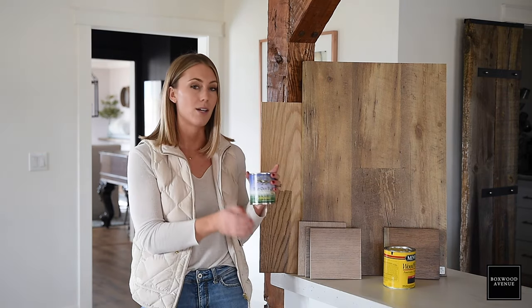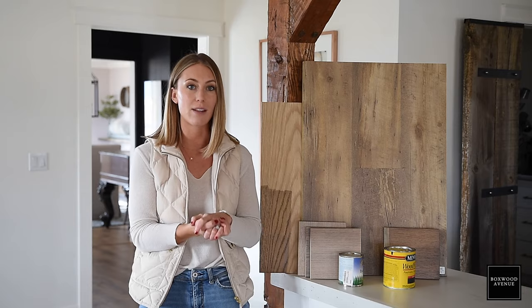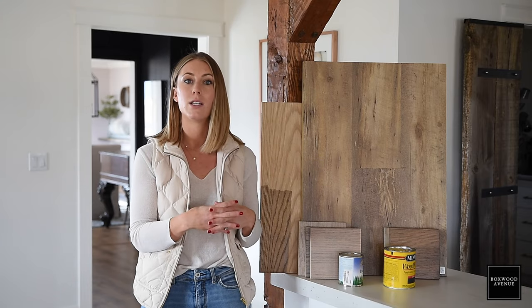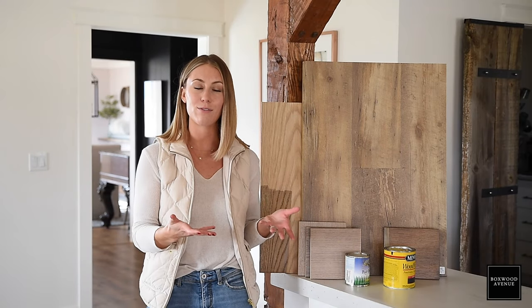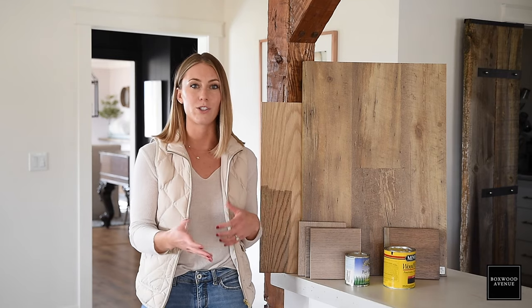If you're working with a piece of wood and you don't want it to have that glossy epoxy feel, make sure you get a matte or satin finish. I really like General Finishes for a flat finish. Old Barn Milk Paint also makes beautiful flat stains. And if you're getting something custom from Sherwin-Williams or your cabinet maker, just ask for a matte finish. One of my biggest tips is to know that you're not confined to what you can find at the hardware store — there are lots of boutique brands that make beautiful colors that won't turn orange or red.